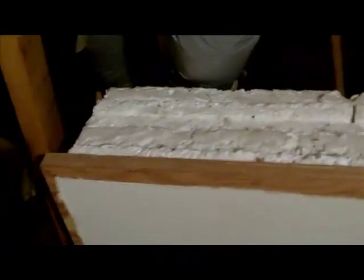One of the other issues that you see a lot in home inspections is the attic scuttle is usually not insulated. In this case, it is. They just took some styrofoam boards and glued them to the top. It totals about six inches of insulation, so that's pretty good there.